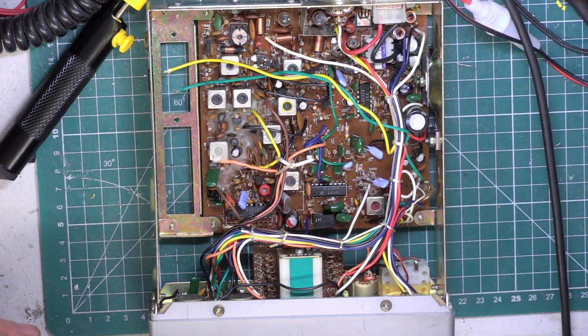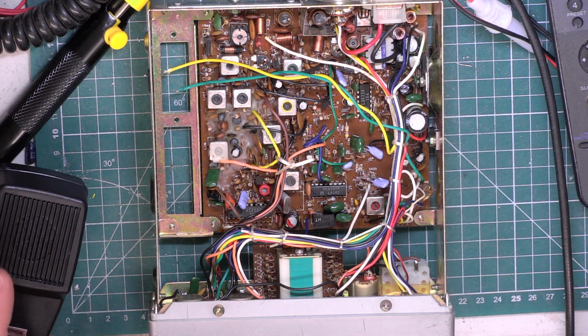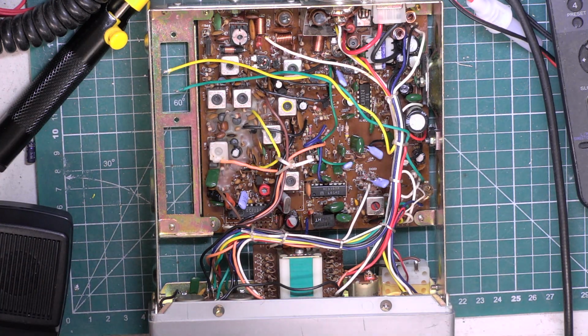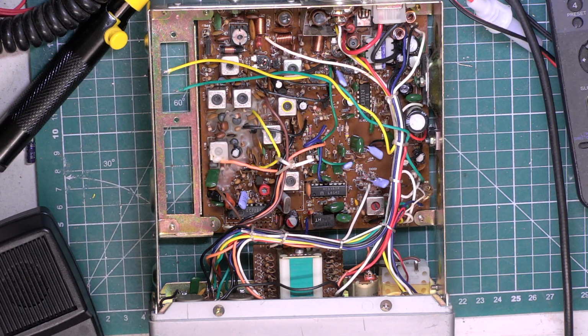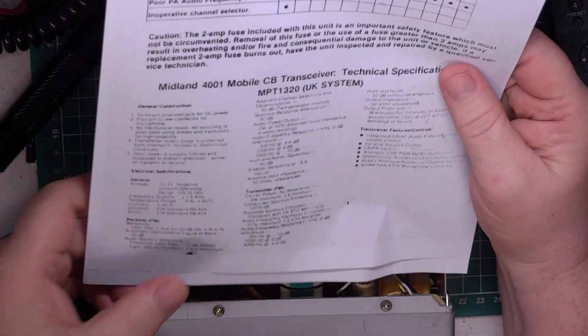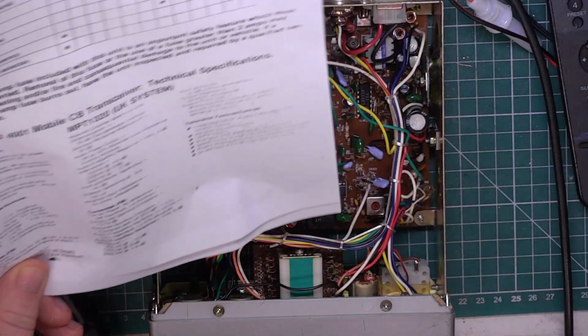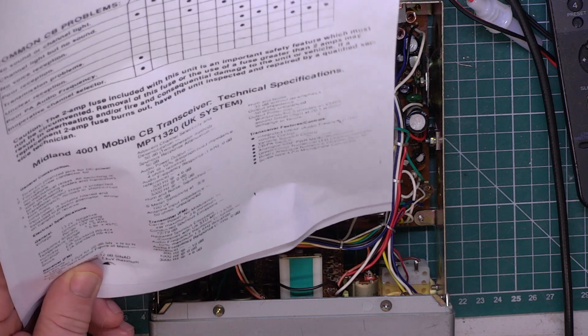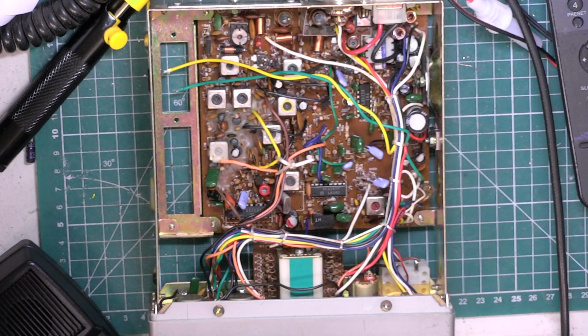We'll switch that on as well. And right now, what have we got? 0.6 of a microvolt for 12 dB. And it's supposed to be... Let's see what it is supposed to be. They're doing it at 20 dB, which is a bit bizarre. So for 20 dB, we've got 1.3 microvolts. They want it to be better than 1. So anyway, here we go.